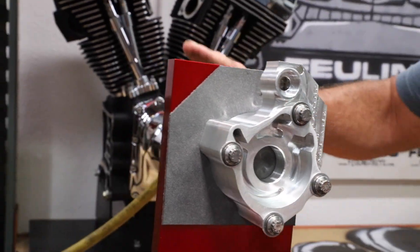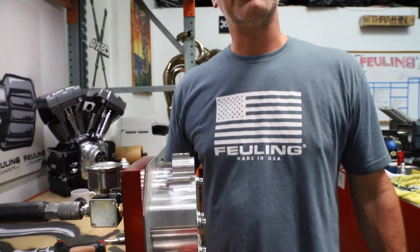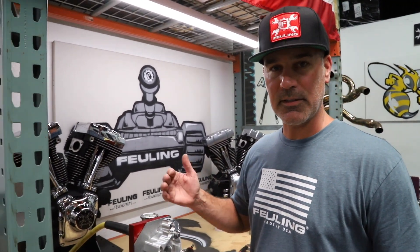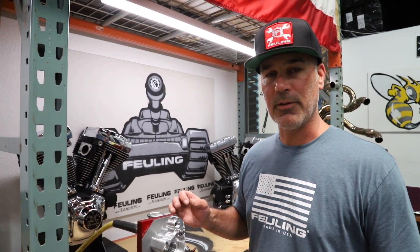This will seal the pump against the plate and then the center standoff seals the inside of the pump. I'm going to go ahead and hook up the shop air to the regulator. Ideally, what we want to see is the valve seated and sealed from 0 to 30 psi, and we want the full pop-off in the neighborhood of 50 to 60 psi. We're not so concerned with the full pop-off pressure, but the main concern is that sealing of the valve between 0 and 30.